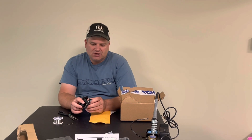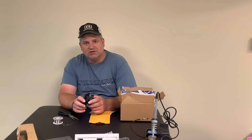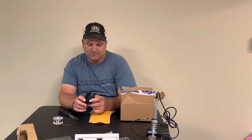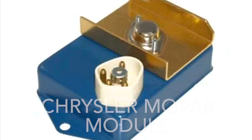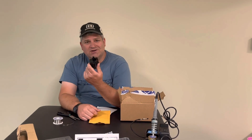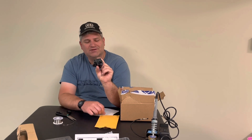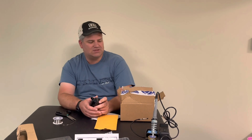If you've seen my older videos, I used a crank trigger with a separate ignition module. The first generation used a GM HEI module; the second generation used a Chrysler ignition module. Those parts are pretty old technology — not getting hard to find, but not as prevalent. In my other setup, I had to buy a 12-volt coil plus the module, and by the time you bought all that, you could be into it for $80 or $90. This LS2 coil was about $22, has everything in it, is smaller, less bulky, and easier to hide on your engine.